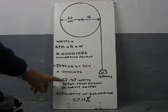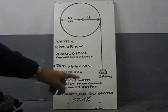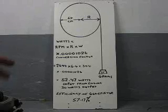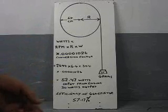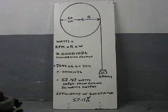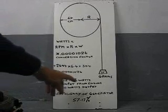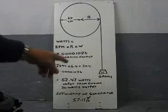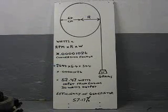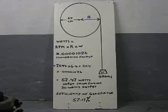So that is the power that the Stirling cycle engine was producing — 52.47 watts — plus the amount of power needed to work the coolant pump and the cooling fan. If we round that up and estimate about 8 watts for all that, adding 8 watts gives us a nice round figure of 60 watts. So we're getting around about 60 watts of power from the engine, which is a little bit disappointing — I was hoping for more — but we can't have everything. So we're getting nearly 1 watt per cc of displacement of the power piston.